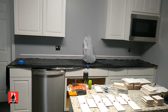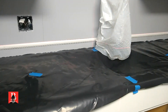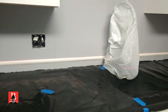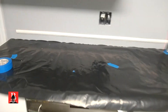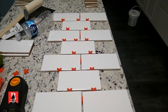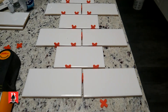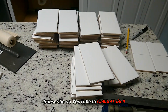Now I haven't put tile down in 30 years. But what I've got here is a laser level — those weren't available to us common folks back then. You can see I've got a little ledger made of a piece of trim there. I'm going to start with the second row working off the center. Got my workspace prepped. I have the plan because I need to know how to hit the right spot on the cabinets. Because of the layout, I'm using a little thicker spacer there, but using them on the end they're an eighth inch. Cut a few end pieces, got my stack ready to go.